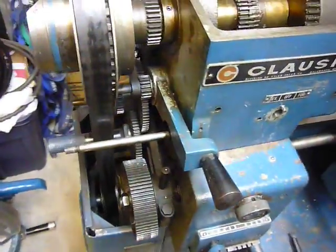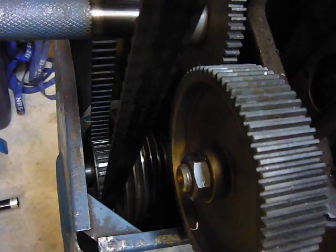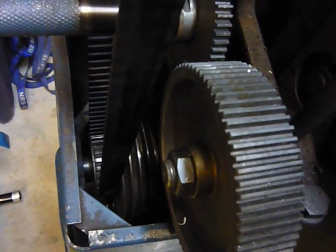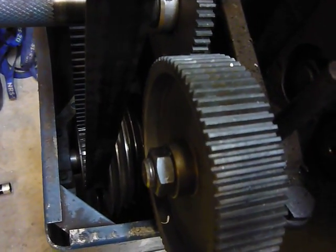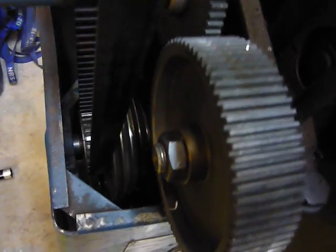This lathe has a spindle pulley. Down inside there's an intermediate pulley that's run by a timing belt — that's a fixed ratio. But below that, from the intermediate pulley down to the motor spindle, you have six choices of belt speeds. You can probably see down in there the little cone of pulleys, way down in the dark deep recesses there.